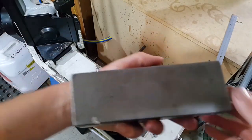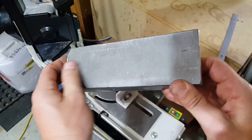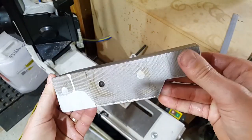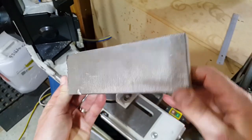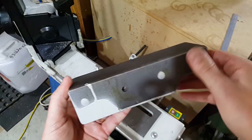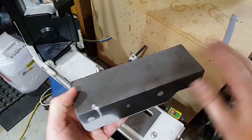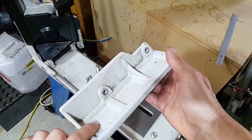As I was saying, I just want to square these blocks off. You can see there are quite bad machining marks in there — they've been sort of just trimmed down for speed in the factory. On this side it's all paint, so you can tell that's not square. So what I'm going to do is just skim that on the shaper, get it square to begin with, and then we'll have a look at the next stage.